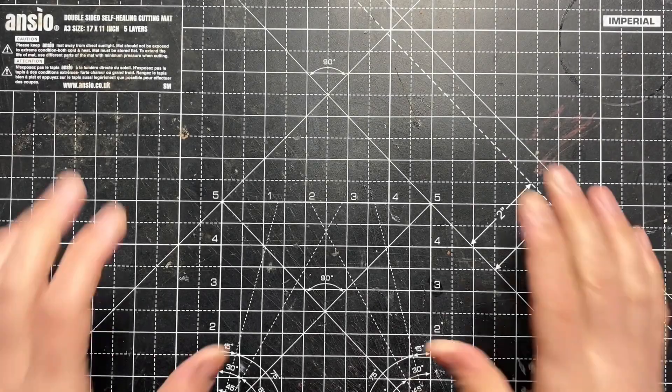The back of the neck is a really interesting angle, because although the direction of the wood is all flowing in the same way, because we've established a dip — a hill essentially — it's going to change how we're carving. The simplest way to understand this is: you always want to carve downhill, never carve uphill. Where that neck and mane meets the back, we've essentially carved a valley — a V shape — and you always want to make sure you're carving down into that valley. As soon as you start carving up you're lifting the wood grain and you're going to split the wood. You can see that point being reinforced as I carve down the hill I've created on the rounded rear of the horse.